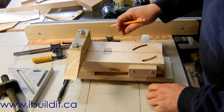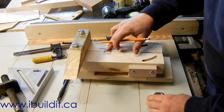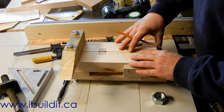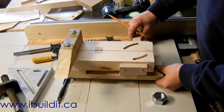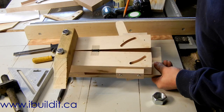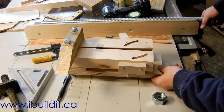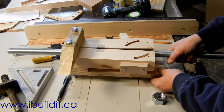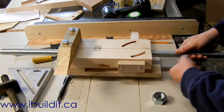Here's what I came up with. The two halves of the nut are glued in right here. How it works is — this is normally how it looks when it's closed. I've got a lever here, and when you push it ahead — I still have to put a stop in — it opens, and that allows the rod to go through it. The rod can slip in, and then once it's in position, you pull the lever back and that's it.